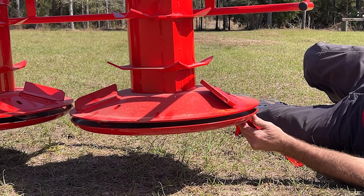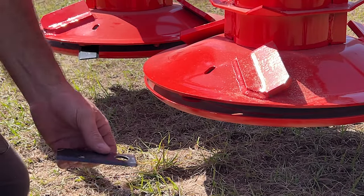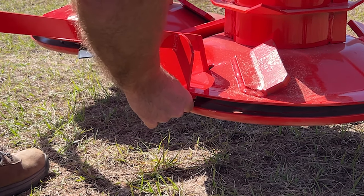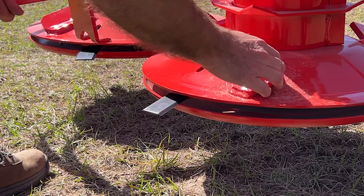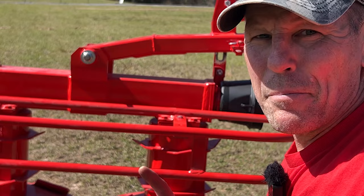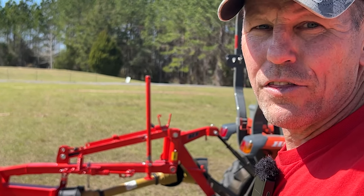I've got four more to put in. You can also do it by feel — rather than lay on your back, you can be up here where you can get more leverage, and then you can feel the peg that it goes on. There's multiple ways you can do it and this seems to be the best way. Even moving the camera, I probably have no more than two minutes invested in putting on those six blades. Now let's set this mower up for operation by swinging it out and making all the adjustments.